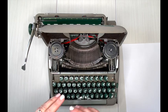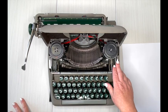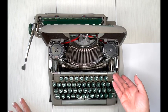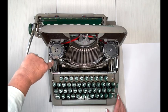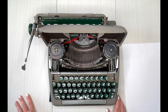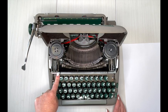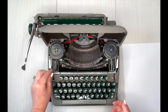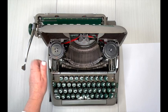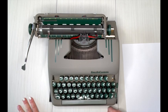You go back and forth many times before you need to change out this ribbon. For those wondering how old their typewriter is, the serial number is stamped on the left side in the metal frame, and you can visit typewriterdatabase.com to look up information. You'll also see a little lever with red numbers — that determines how hard the type bars strike your paper, so that's just personal preference.